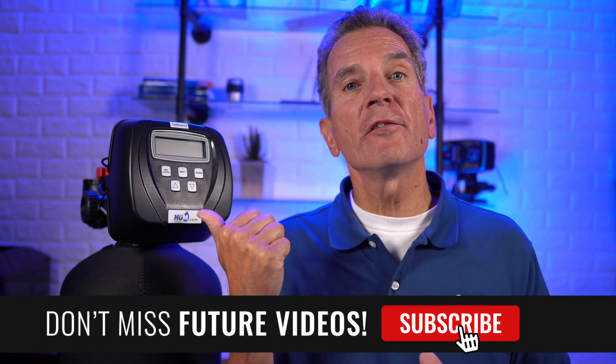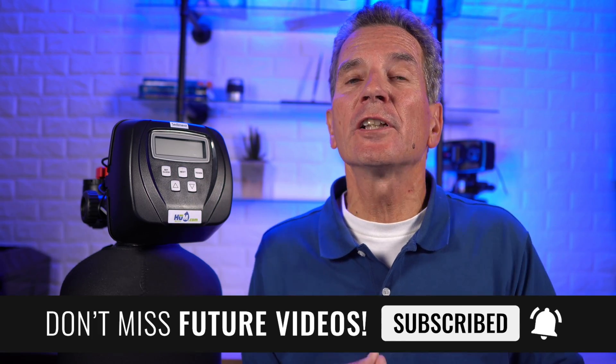So what's the cheapest and best sediment filtration for your family? If you don't mind changing filter cartridges fairly often, going with several sediment filters from coarse to medium to fine may be the best route. A spin-down filter before the pressure tank combined with a fine sediment filter before your UV disinfection system is also a good solution, but requires more maintenance — and remember, that spin-down is a very coarse filter. Many folks go with automatic backwashing filters, which offer very low maintenance, and that's something a lot of families really appreciate.